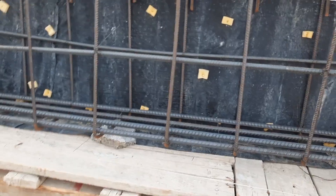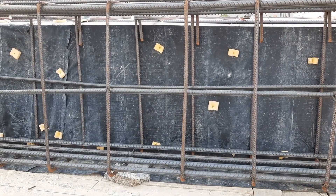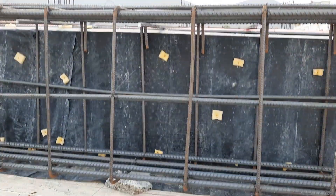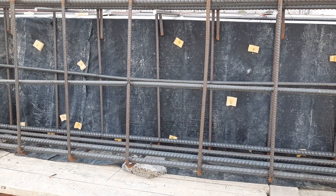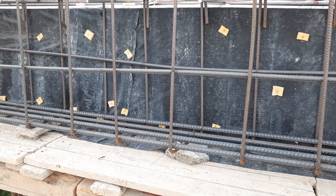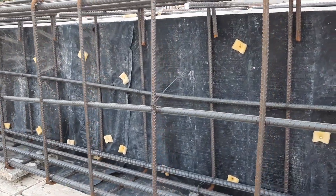You can see clearly: depth is 22 inches, width is 12 inches — this is the size of the beam. We have four steel rods at the bottom in the tension zone, diameter is 16 mm, and three steel rods at the top in the compression zone.